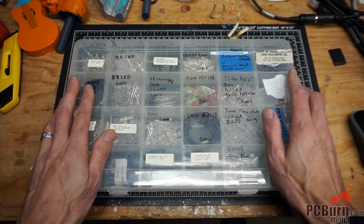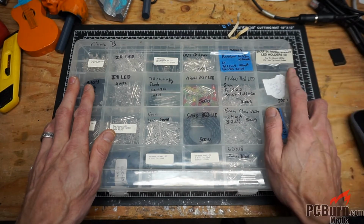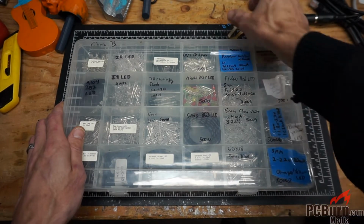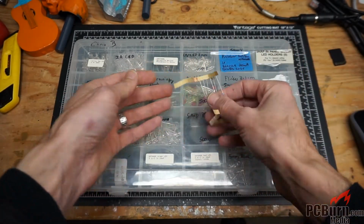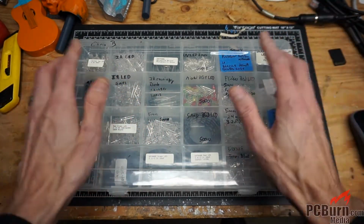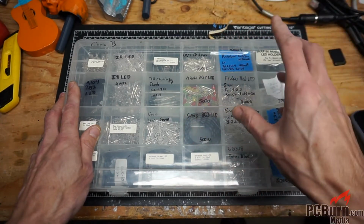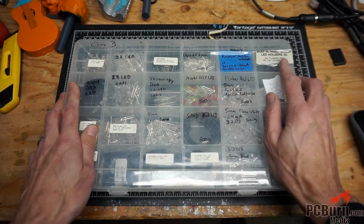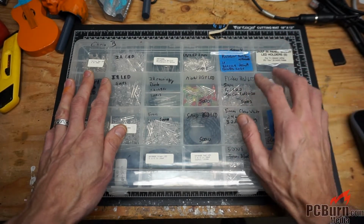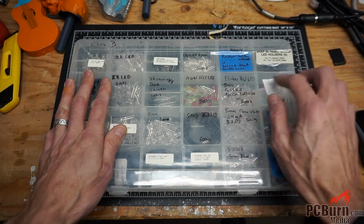There's many calculators online that'll just give you a quick number for the resistor you'd like to use for any given forward voltage on your LED. So that part's pretty straightforward. And the resistors I'm going to be using are just a 22 ohm resistor. It's kind of in between the values on these. I wouldn't recommend just using a single value like this for whatever you're using, but these will make anything work. What'll happen is if you use a resistor that's too low of a value, it'll burn out the LED quicker. So just something to account for. If you use a resistor that's a bit higher value, generically it will just limit the light output from the LED if it lights up.